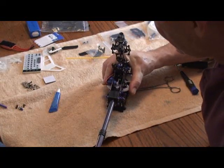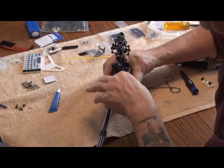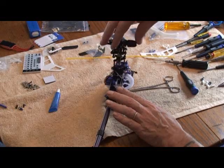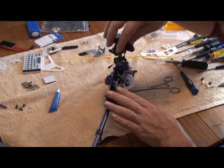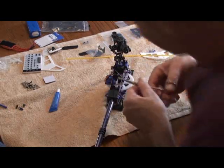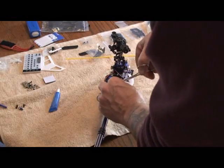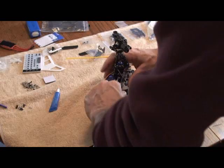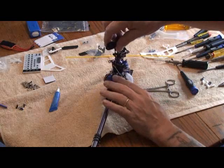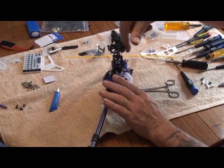Slide your boom back out just a little bit — you want just enough tension so the belt won't touch itself and it looks pretty good. Now check — we do have a little bit of binding, which tells me that belt turned. So slide it back in, take it back off, and ensure there's no binding at all in that belt. There it is — that's perfect, very nice and smooth. I don't feel any binding in it at all.